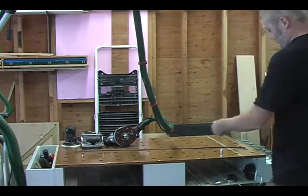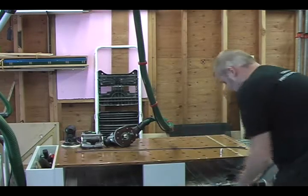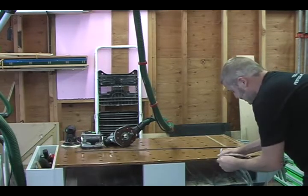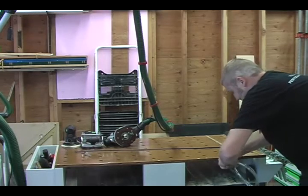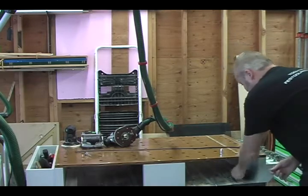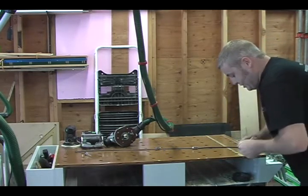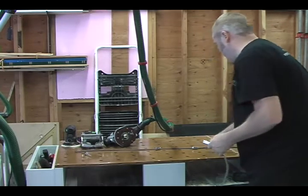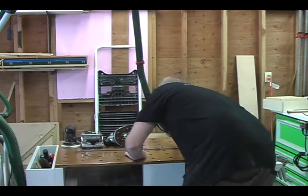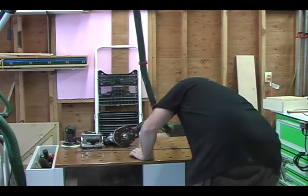The first one is going to start right here, so we're going to stick that in and get it up as good as possible. Now we don't need this plug dog anymore. We'll get rid of that. And this is just a dead fit, slides right in. Now what we want to do is get the vacuum gauge off, and now we're going to be using all 3 parts of the manifold. So this one, I'm going to do dog, plug dog, dog, plug dog, dog. So this one's going way over here. Get that in there good. Then you put the plug dog in.